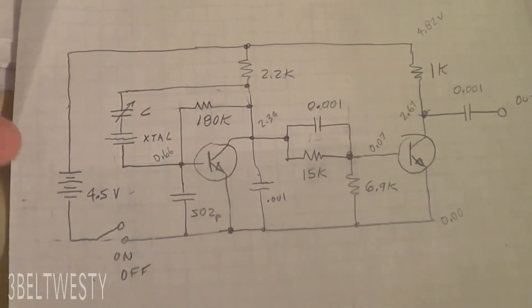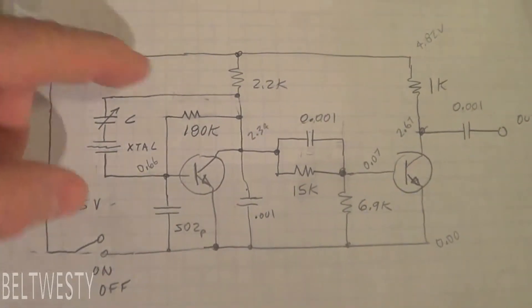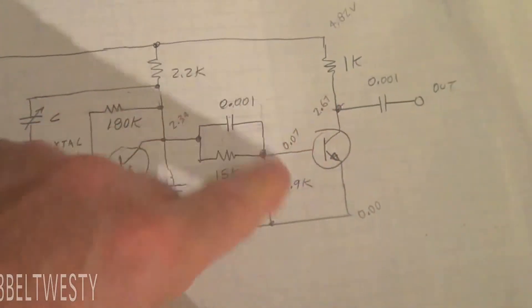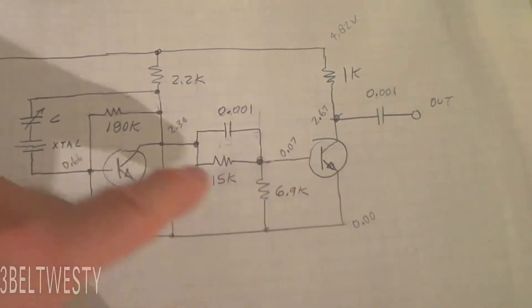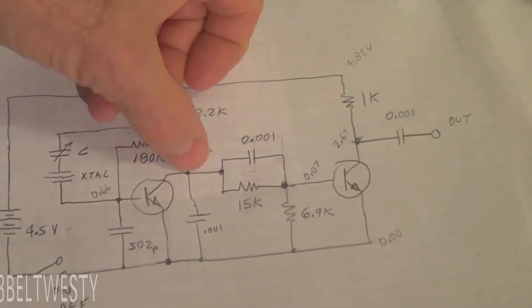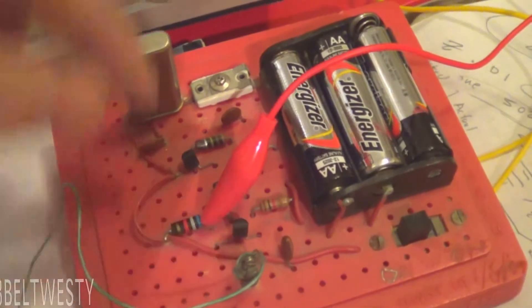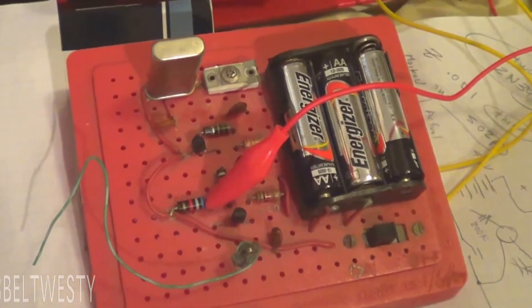I went through and traced the schematic because I can't find the paperwork and didn't find anything on the internet. The base should be about six tenths of a volt higher here — I measured with a crummy meter so take these numbers with a grain of salt — but there should be output and right now there's nothing. The 2N3904 is probably shorted out, maybe because I hooked the batteries up backwards a long time ago, or just because it went underwater.